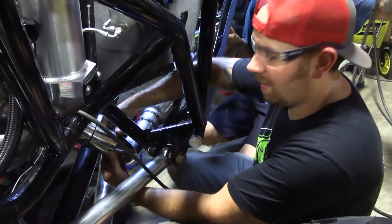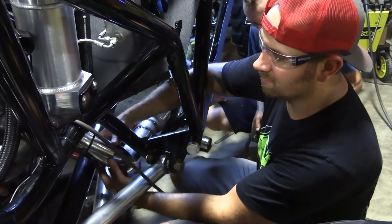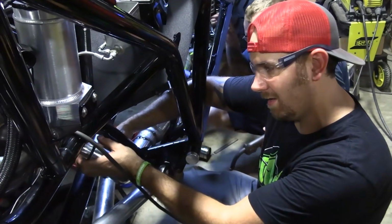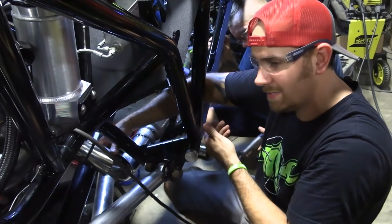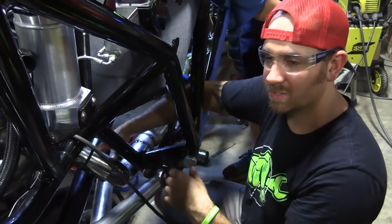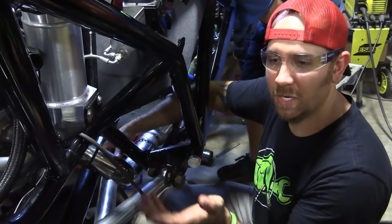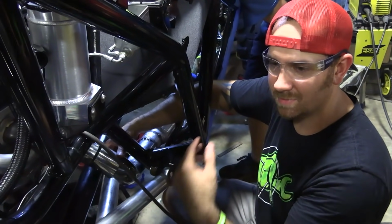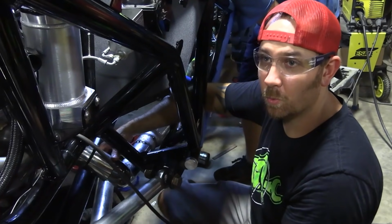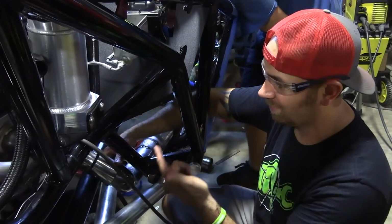We're basically putting this exhaust on, and we like to use headers that are pre-built so we don't have to build all the headers, but we have to cut off that flange right there and then turn it really sharp and then turn it and go back down to make sure that we clear the driveshaft. And the only reason it's so difficult is because we have a lot of up travel in our chassis, which a lot of guys don't. A lot of guys take the cheap route. They put 14 inch shocks in the front, give you about 5 or 6 inches of up travel, and the exhaust is super easy. But here, we're wanting a lot of up travel with 16 inch shocks, so the driveshaft comes up really high and we have to dodge it with this exhaust.